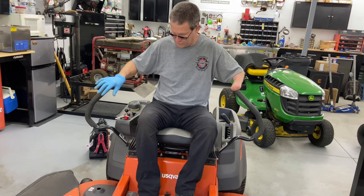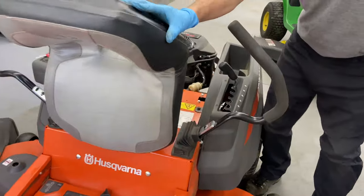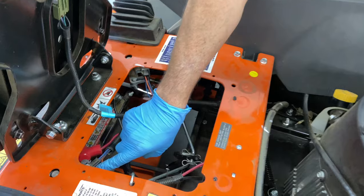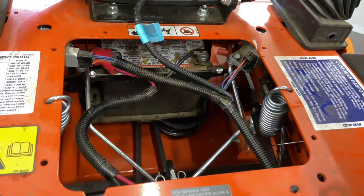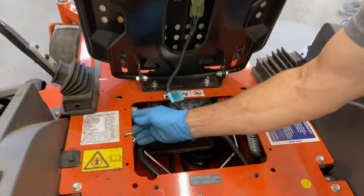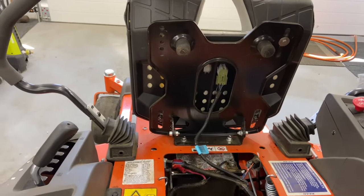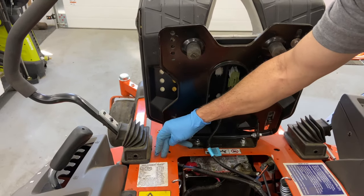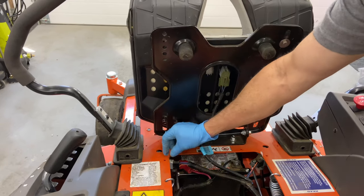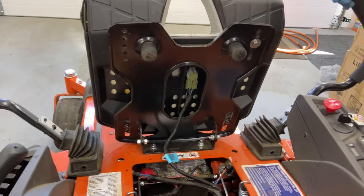These have safety switches on the handles, and that's also how they engage the emergency brake. Underneath the seat, when you pull your handles in towards your body, the safety switch has a little pin. When you push the handle all the way out, it brings your safety switch into contact. If this is slightly off, the piston is out of the switch and it will not start. Make sure your handles are all the way out on both sides.